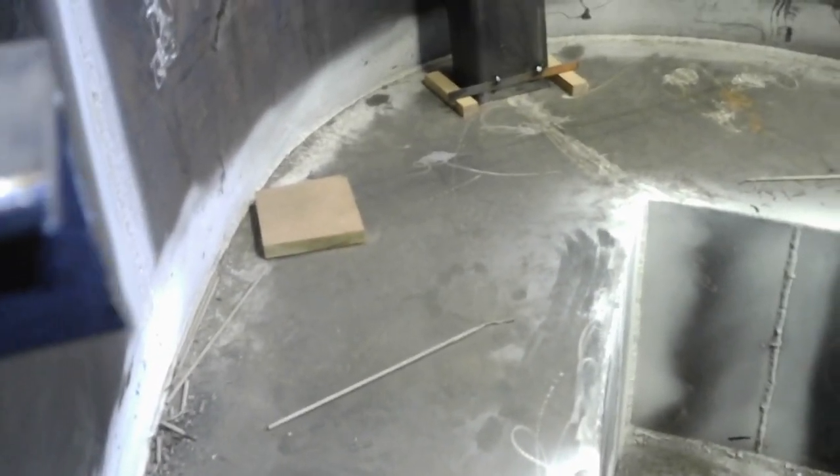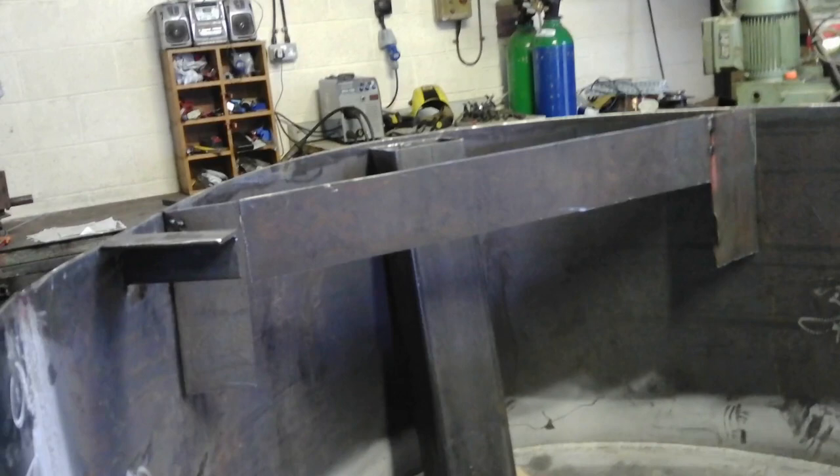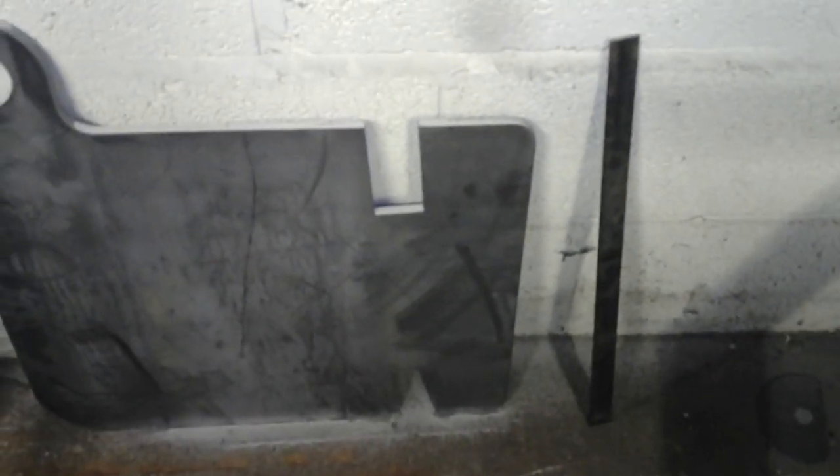The back's still the same. Going down the blunt end - I've just got that box section through. That goes straight through the diesel tank and goes up to your rudder, so that's your rudder tube. The bar goes through there to the rudder. That's the plate that's been profiled out - you can see those cutouts. They're on a 5-degree lean, so this tube doesn't go plumb straight through the boat; it's actually on a lean, 5 degrees vertical, as you can see on that there.